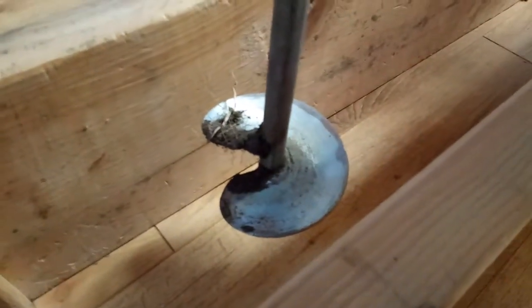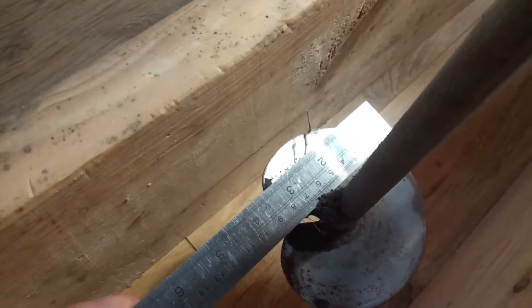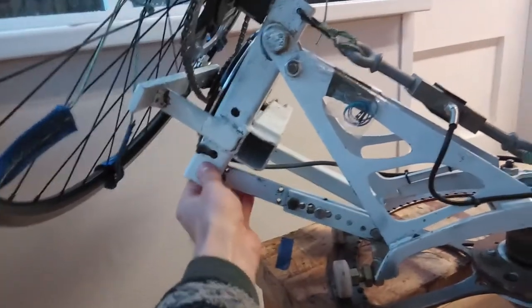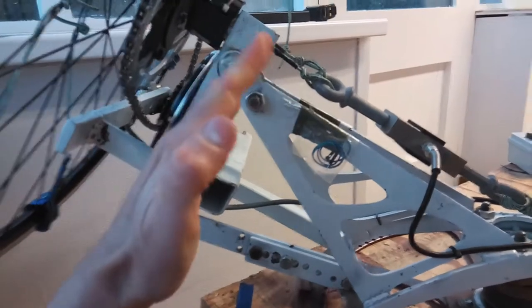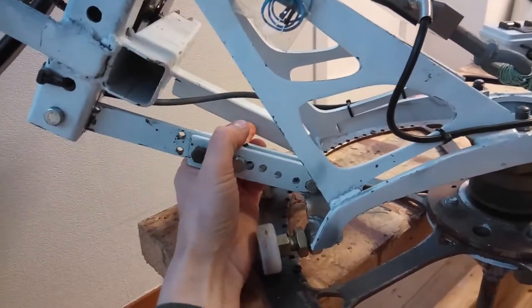There's just a standard plate anchor under there — I think that's 60 centimetres, 300 kilograms vertical. Roughly 10 centimetres diameter across that. This bar here gives you an elevation adjustment — I can change the pegging through these slots, which lifts this head up. It basically sets that length through here, so this whole assembly at the back end will tilt up with that if you lengthen it out. Nowadays I've set it solidly with another piece there, because it was all a bit rattly.